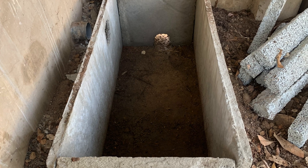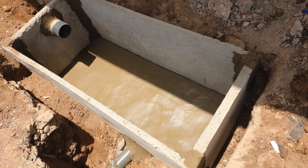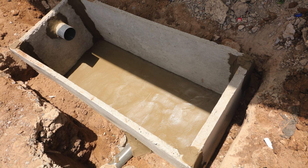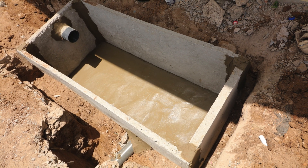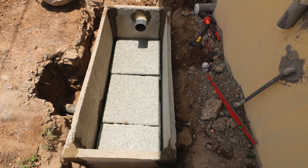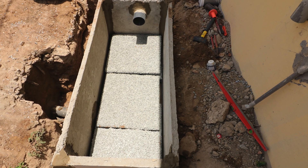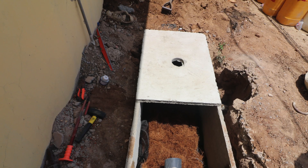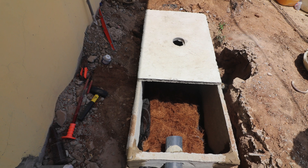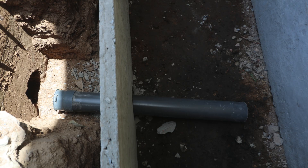After you have done your setting, your digging, and the construction — whether you are using blocks or fabricated slabs — and all the setting has been done, the biodigester itself has had filtration done, the porous system done, and your fiber or organic materials have been laid on the biodigester bedding, the next thing is to know where the leachate pipe is going.